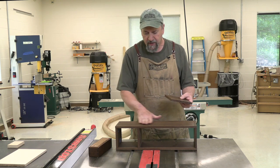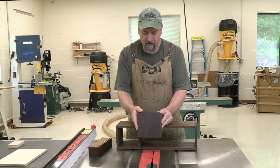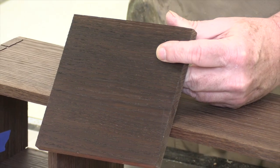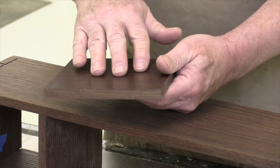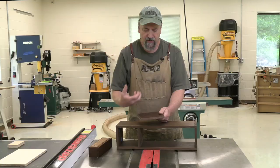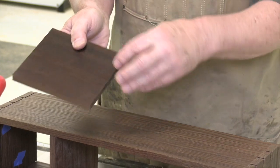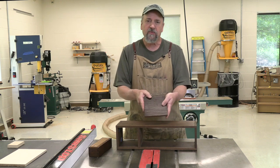There are some caveats there, but I do like the look. This piece is unfinished, and this one here just has a couple coats of blonde shellac on it. It is a dark color, but it also has some red hues coming through. It really reminds me of a traditional Stickley finish, where there might be a fume finish with a red or orange dye underneath, with a darker stain on top — and as the years go by and that dark stain tends to wear, it starts to bring up these orange or red highlights. This reminds me of that, and I think that's pretty cool. That was always a look I tried to get and was never able to duplicate successfully, so there could be something there.